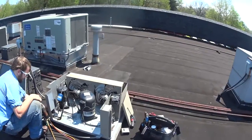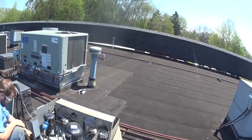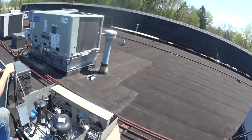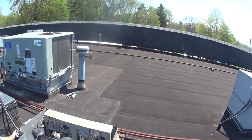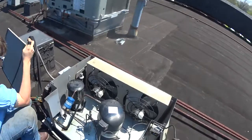This is a flower shop and it's the condenser on the roof - a Heatcraft condenser. It's R404 in this system, not R22. It was low on gas; I put some gas in it last night and I found the leak on it. Here's the pressure control here.